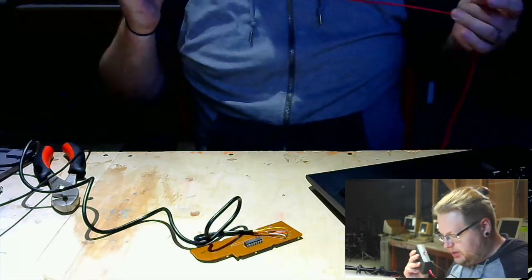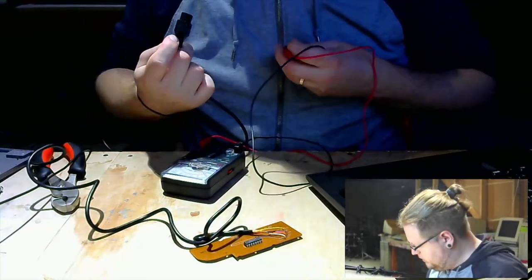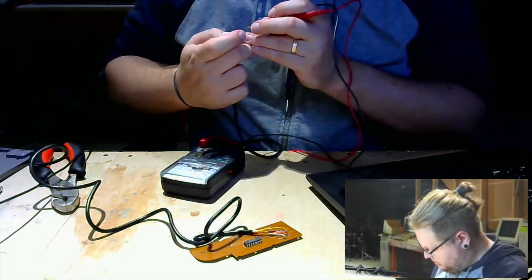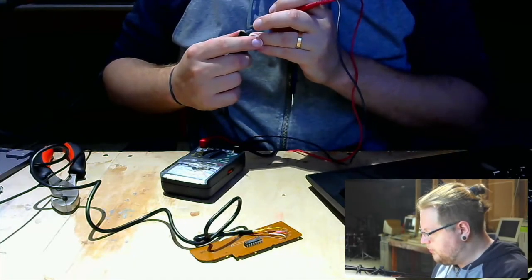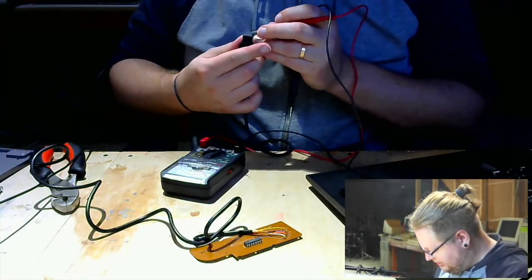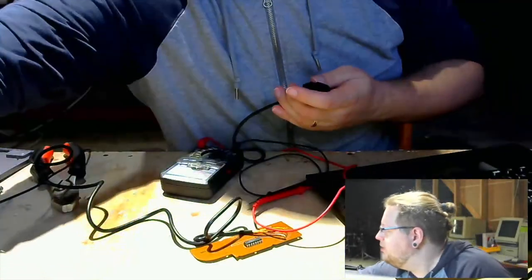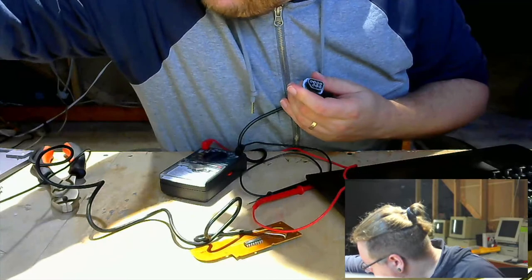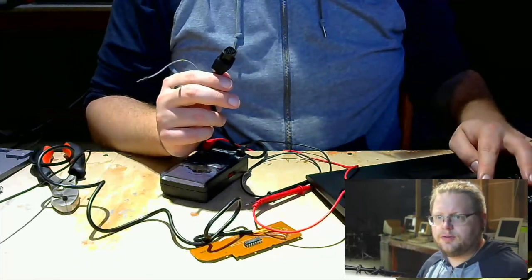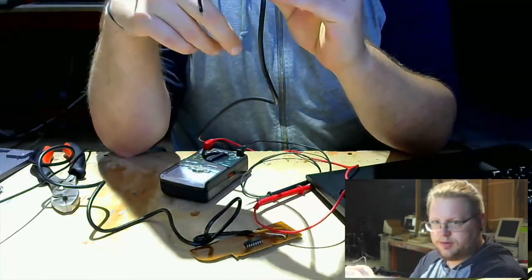So, reconnected. Let me start by checking to see which one of these wires is the latch wire. Assuming I can get a probe in here, maybe. And pop that one out and just attach an LED to it for now, so that we can keep resetting the console a bajillion times and adjusting the cart slightly until it works. Let's just use a jumper wire. Don't have one right here. I've also already forgotten the in and out. Okay, it was opposite side of the chamfer, second from the bottom.